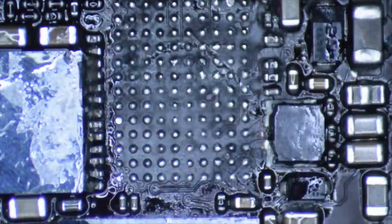Let's get this cleaned up so we can see what we're doing. Zooming in a bit — there is our defective pad. As far as I know, that seems to be the problem: the second one from the left on the top row. That one likes to come loose and not have a solid connection, for whatever reason. So we're going to augment that connection by adding a small piece of jumper wire.